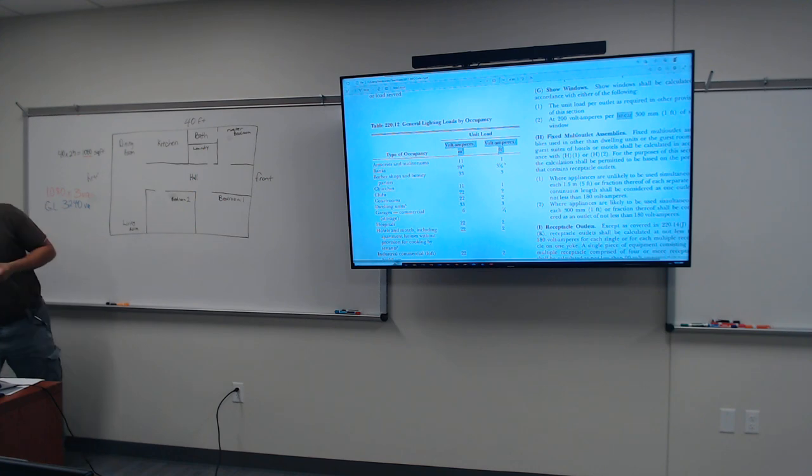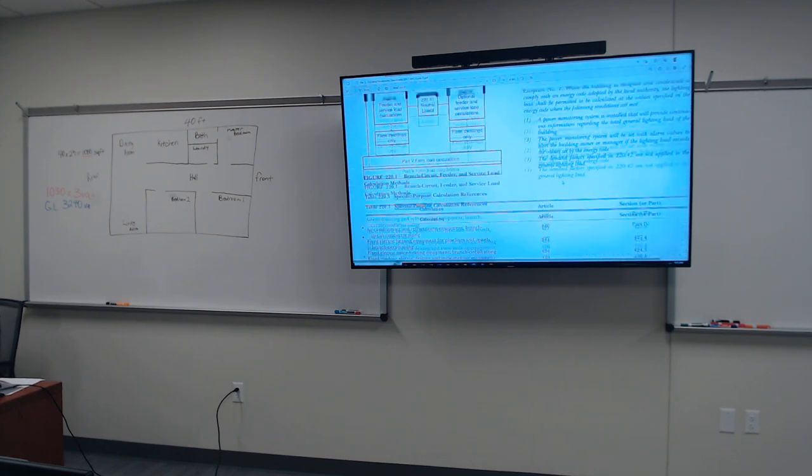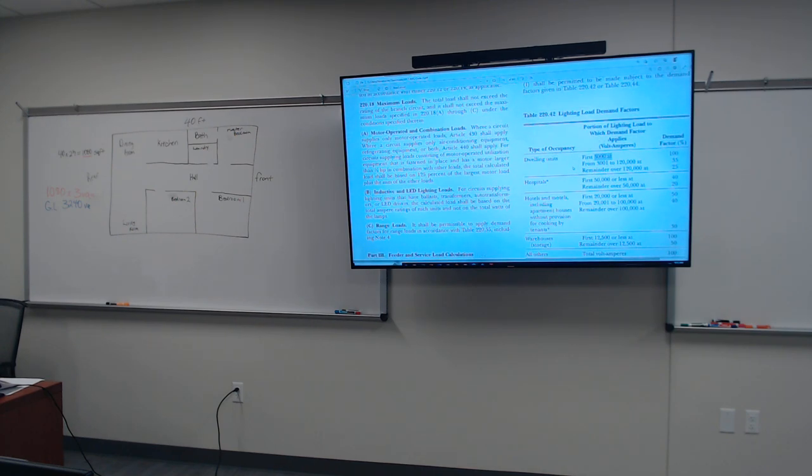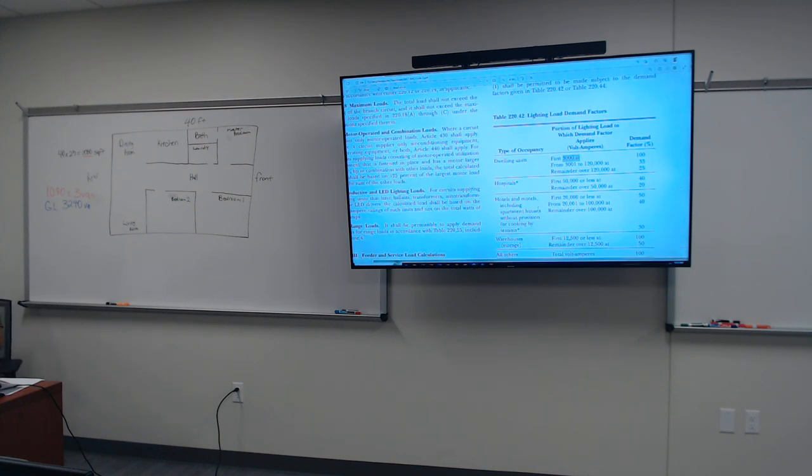All right, so that's not the final number. There's a process to this. Now, let's go back into Article 220. Let's look at Table 220.42 on the TV screen. It says, if you're figuring out the lighting load demand factor, like I said earlier, in the dwelling unit, which is your home, the first 3,000 is at 100%, okay? Then from 3,001 to 120,000 is at 35%, okay? Then anything over 120,000 is at 25%.